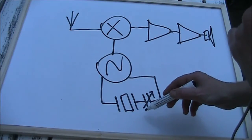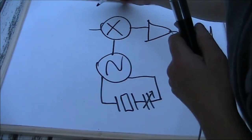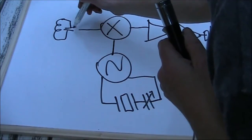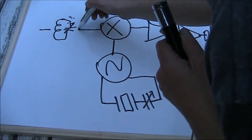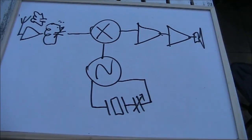That uses a crystal, which is one of our components that is frequency dependent, so you'll need to change that to go to another band. The other frequency-dependent part of a direct conversion receiver is the front end. All but the crudest designs will have at least one tuned circuit, and ideally two. The resonant frequency needs to be changed to that of the incoming signal to get reasonable sensitivity. In a direct conversion receiver, most of the gain is in the audio part, which is fine for 3.5 or 7 MHz. But as you go up in HF frequency, the amount of band noise declines and the gain you need increases.